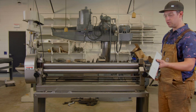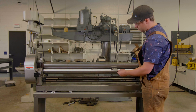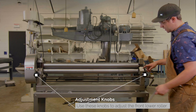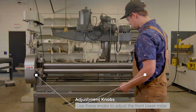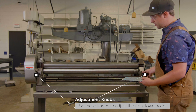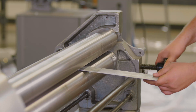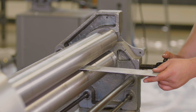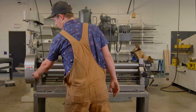What we'll do is take our sheet metal that we need to be rolled and insert it in between these two gaps. If we're too tight, we can use this knob here as well as this knob here to loosen or open that gap further apart. We'll slide that piece in, then tighten our knobs down so it holds our piece and make sure that it's even on both sides.